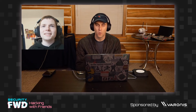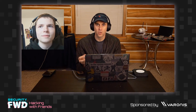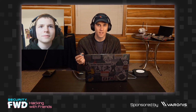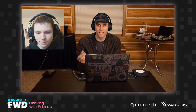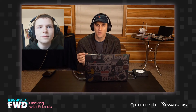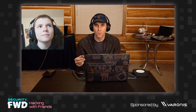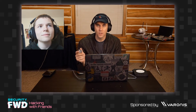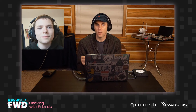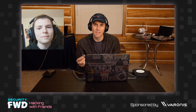So the benefit obviously is you have a lot more to work with. This has more power behind it, and you'll see applications for the ESP32 like strapping a small camera onto it and having a camera module like the ESP32 cam. You don't really see a lot of ESP8266 camera projects, or at least I haven't seen a ton of them, just because you have to really have an ESP32 to get good quality video. And on the ESP32 cam modules I've seen, it even has the extra horsepower left over to do things like facial recognition and facial detection, which is pretty awesome to have all that power in such a small chip. So there's a lot more potential in this bigger, more powerful ESP32, but we also don't get total freedom. So, when you're looking at getting started on one of these, you might be one of those people who wants to get the slightly more expensive but better product.